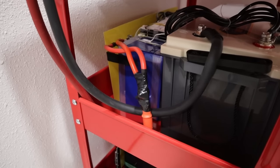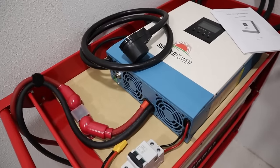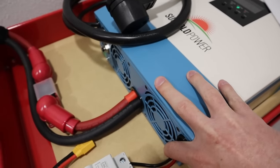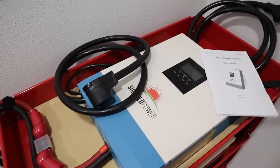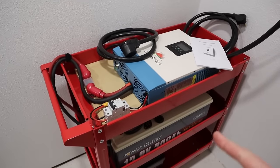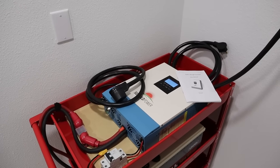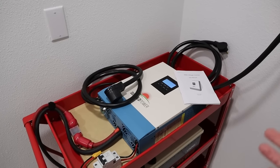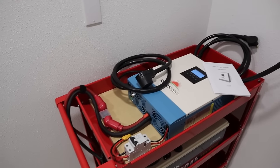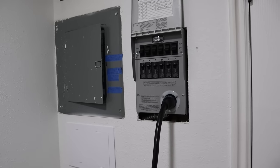I have the main connection tightened up with main negative and main positive connected. I'll check with a voltmeter to make sure everything looks good, and then insulate the connection so it doesn't short out on anything. With the main connection insulated and the access panel cover back on, it's time to turn it on for the first time — just flip this rocker switch. We do have to set this up to work with lithium iron phosphate, all that information is in the owner's manual. Then I'll test the voltage output, the sine wave, and see how much power it uses sitting idle.